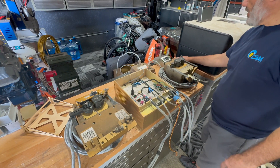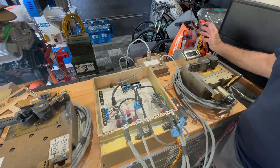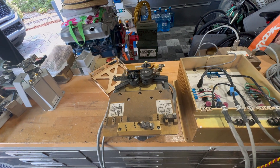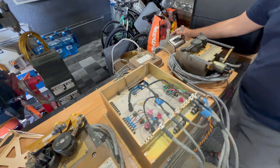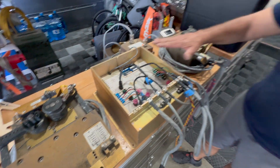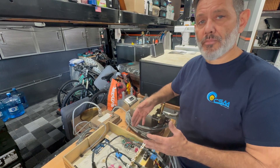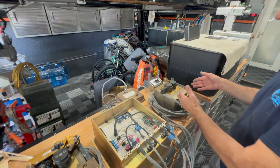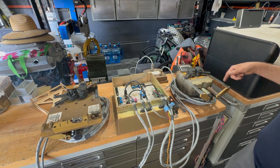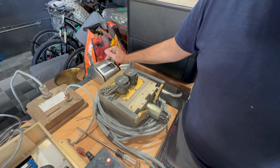Make sure everything is lined up. The two clicks are your best friend — every time you go to a boat, if you hear those two knocks, you know the system is working. And we're seeing this actuator is working good. So what does this tell us? Not always is the information being provided to us the correct information — we should go a little bit further. If you had sent this in, yes, we would have rebuilt it. But if you look at his actuator, it does need a little tender loving care. We'll present that to him and find out what he wants to do. But it is working.